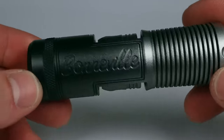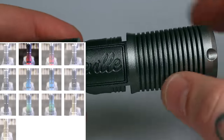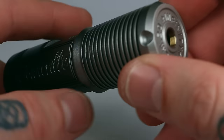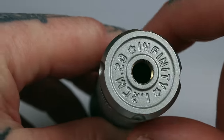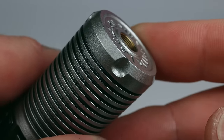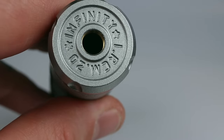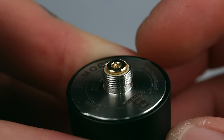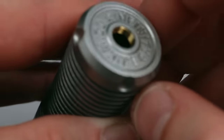Here she is in a black fading into silver sort of paint job. There are multiple options - you've got blues and reds fading into black, straight colors of just black and plenty of others. Starting up at the top, you've got a 24mm taper around the platform, and about 27mm at the widest point on the mod. All of your 24mm atomizers will look pretty good on here. Your 25s will have just a touch of overhang. It is a hybrid connection - so remember, with any hybrid mechanical mod, you need to make sure the pin on your atomizer is hybrid safe. Make sure the gold portion is sticking out further than the stainless steel threads. If it's not, do not use it on a hybrid mechanical mod, and never, ever use a sub-ohm tank on a hybrid mech.